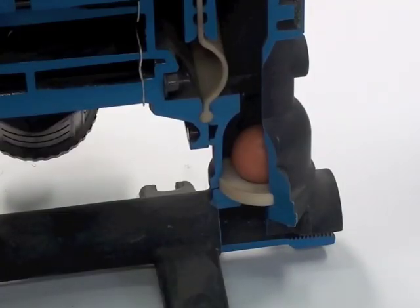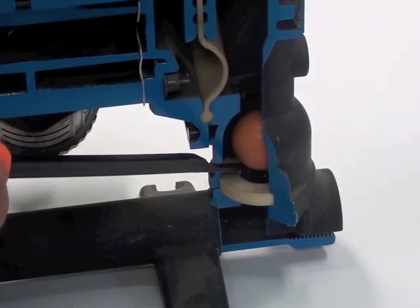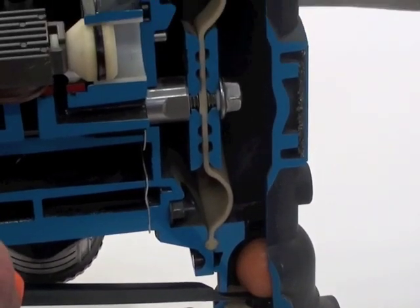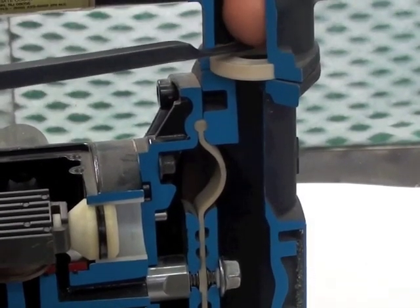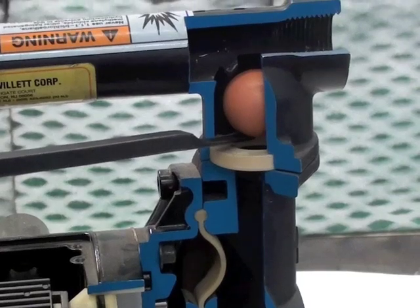When the suction is generated, the lower ball lifts and material enters the fluid cavity of the pump. When the opposite side is sucking in material, the other side compresses material. This closes the lower ball check and opens the upper ball check, which forces material up and out of the discharge of the pump.